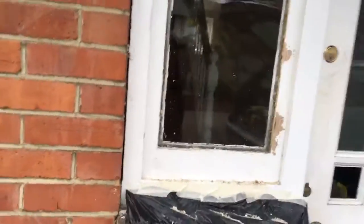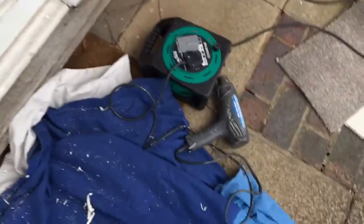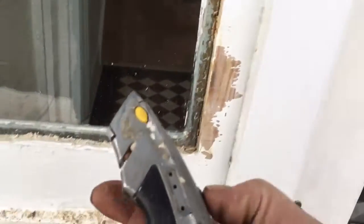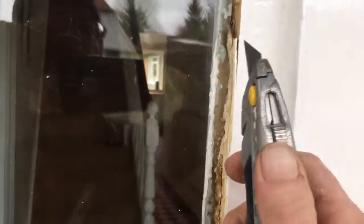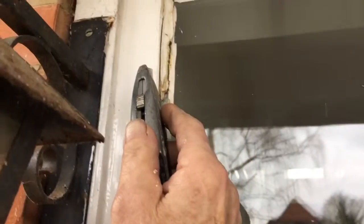Now I'm working on this window and front door setup. The caulking around the window is bad. These things are usually a real pain, but I've just taken my heat gun and warmed it all up. Some parts of it right here were like putty and just came right out. Up here and on that side it's a different story, but all I used was the Stanley blade — I warmed things up, came along this edge a little bit, chopped it off. See, there's a big piece that's come off right there. Same thing over here — I cut that one already.